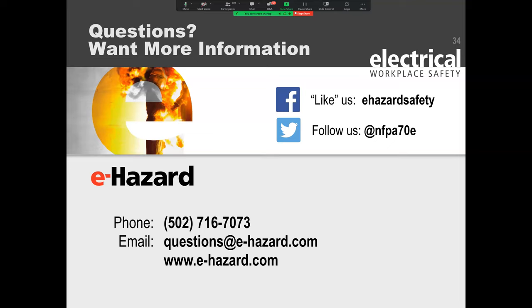Personally, my preference has always been leather. But if you are using safety tennis shoes inside the arc flash boundary, you have to make sure that it meets the test requirements and it has an arc rating on it. If it doesn't, please do not use it. We've tested those shoes and they do melt.